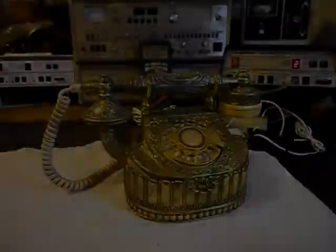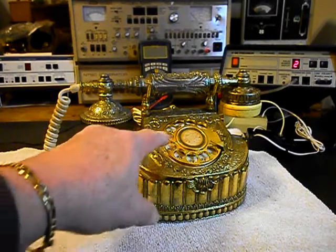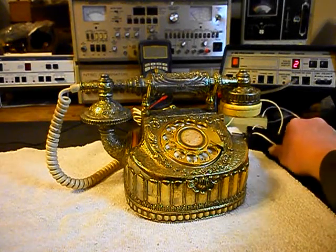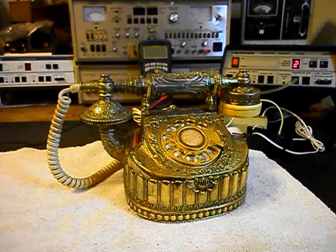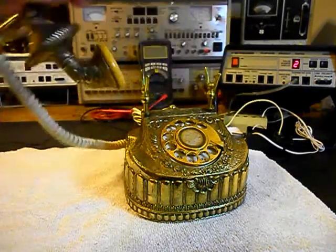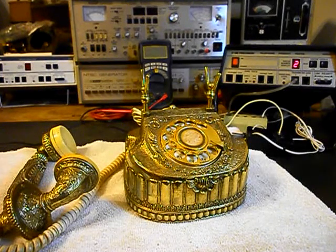Hello, hello. So now that we know this telephone is ringing on a ring cycle, it's dialing out, it has transmit and receive, we can push this button on the switch box — that gives us a line out and totally takes the analyzer out of the situation. We can call a time and temp number. We'll go ahead and give you some dial tone, turn on our amplifier, and dial that number.